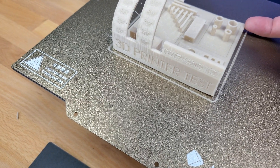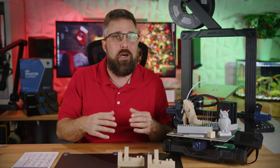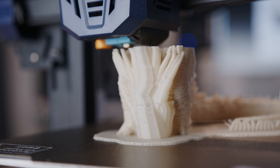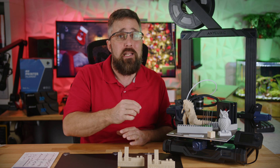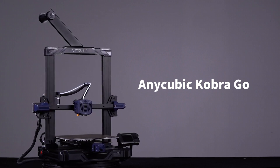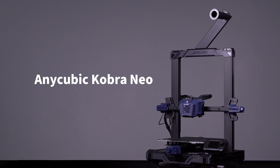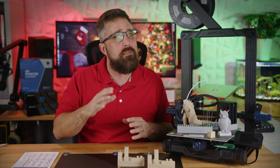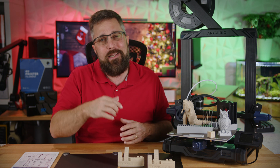Out of the box, the print quality wasn't perfect, but now that I've properly adjusted the machine and figured out the slicing settings, I can turn it on, let it auto-level, set the Z offset to minus 0.32 for this machine, start a print, and walk away knowing that I'll have a good print when I come back. Overall, I think the Cobra Go is a solid choice for the price and perfect for a consumer with some 3D printing experience who's looking for a low-cost machine. But if you're a beginner, you might be better off with the slightly more expensive Cobra Neo — the Go is a cool kit, but the Neo is probably a better fit for first-time users. Let me know what you think in the comments, and don't forget to check out the link in the description for current pricing and availability. As always, be sure to hit that like and subscribe button, and I'll catch you in the next one.